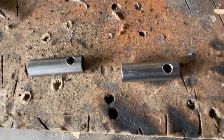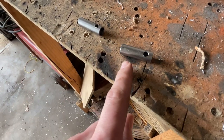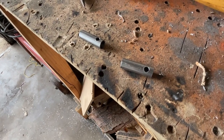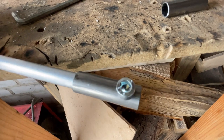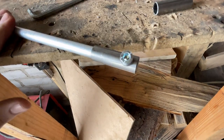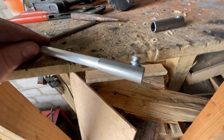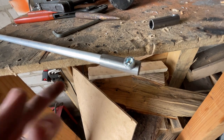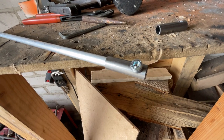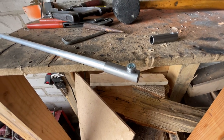6mm hole in each sleeve. Now we can drill it and we have to make a bracket over here for the hand joint to attach on. There you go, the top is mounted just like this. The steel sleeve, the steel piece of pipe, is now very snug on the aluminum - you can just see it's like a splined axle where a machine maybe puts a keyway in it. But this way you just screw it - it's way cheaper and works the same. So this is the way I'm going with.